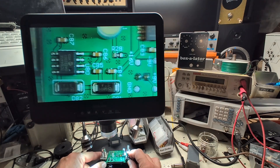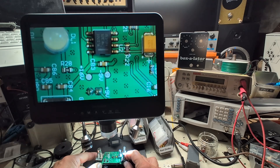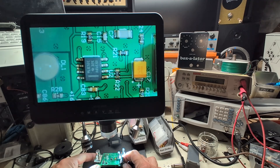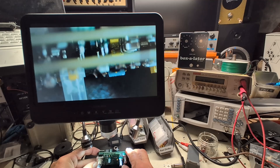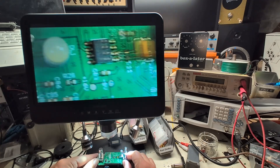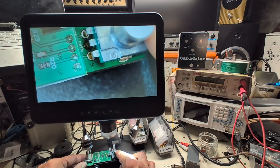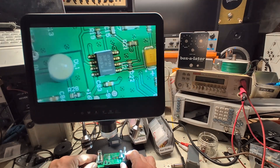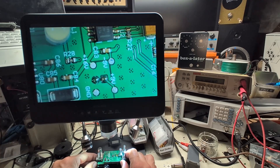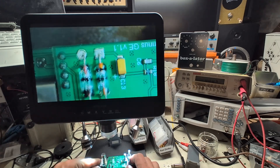The 1044 has test points: +16V, -9V, and +9V. That +16V rail looks like it's going to one of the op amps. A Klon circuit usually has two op amps — I think the other one is hidden below this board. If I were the designer I'd hide proprietary circuitry there — it has four soldered joints on each side making it hard to remove. The +16V plus +9V gives about 25V of headroom on the second op amp, which makes it a very nice clean boost.